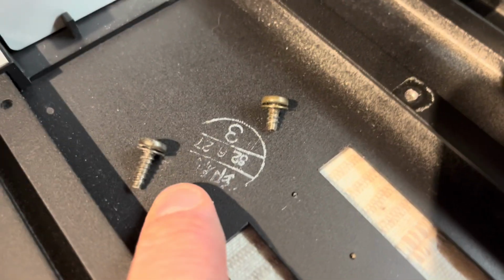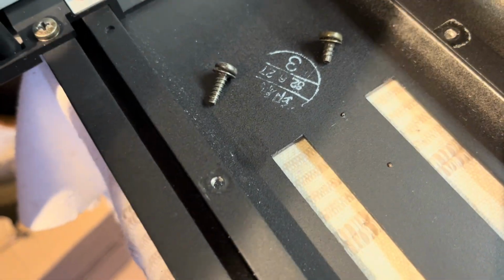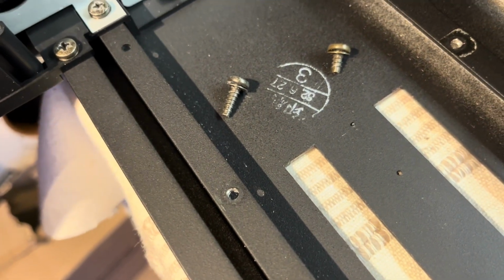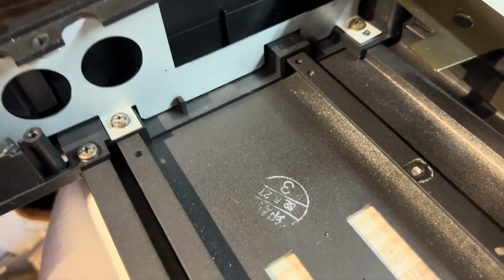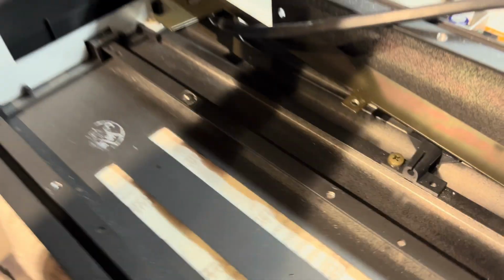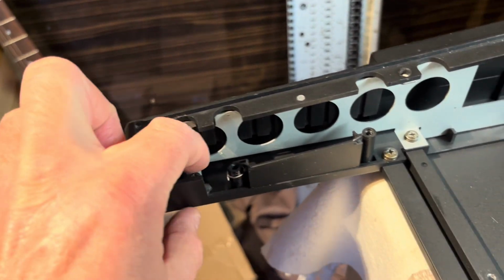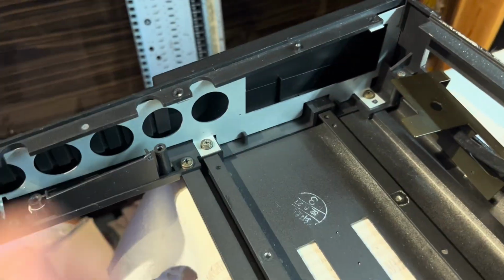And because they're self tappers, when you put them back in, turn them counterclockwise until it drops into the original thread, because you don't really want to be cutting a new thread there and ruining the strength in the hole. So that's a little tip there. So yeah, long ones in the front, short ones in the back for that one. This glue's still setting, so I've got to go easy on it, although it's already in and in place. It should be okay.